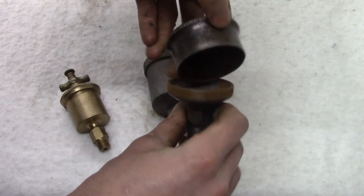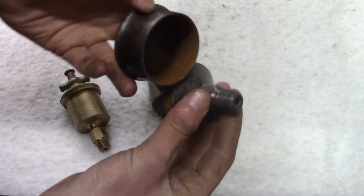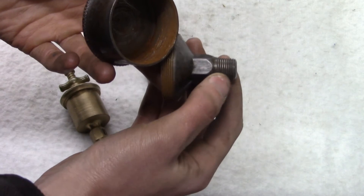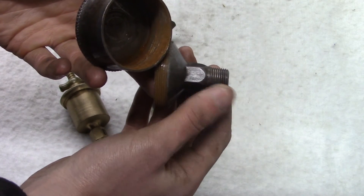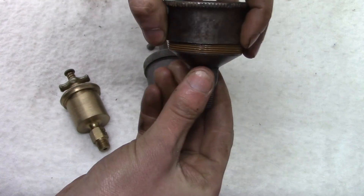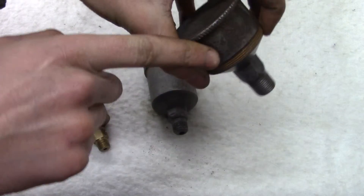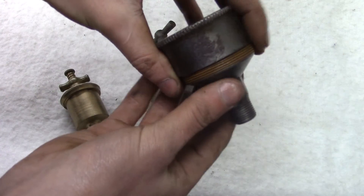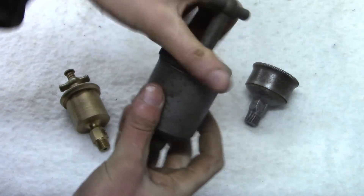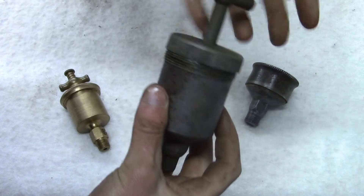The first type is the most common type you'll ever see. It screws apart — that's it. It's just a cup threaded in pipe thread over here, which will screw into your bearing or whatever is going to be lubricated. You pack your grease into this cup, screw it together, and as you screw this cup down it forces the grease out and into the bearing. Very simple.